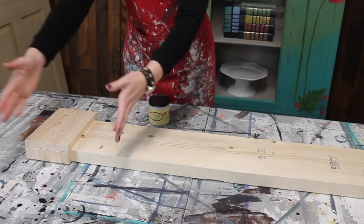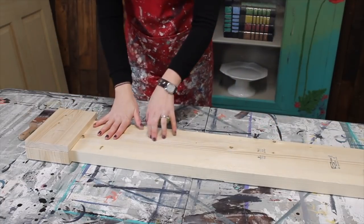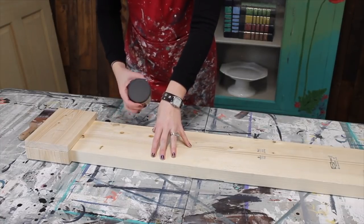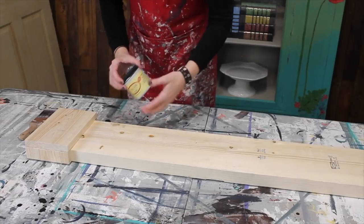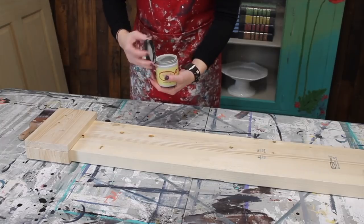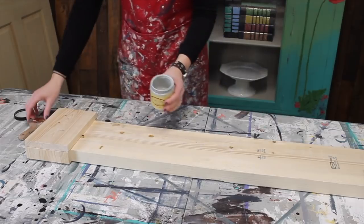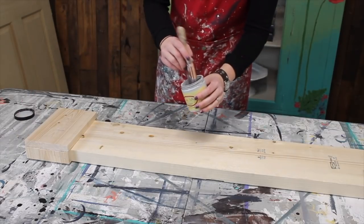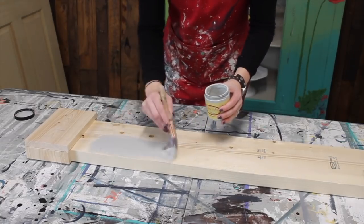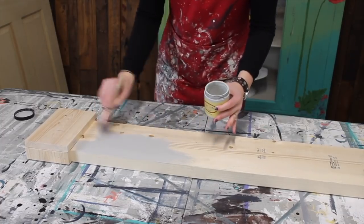Here is my piece. These are the two sides of the mantle that will go down. It is just raw pine. I actually have not done a thing to it, and I don't mind some of the texture — I'm okay with the roughness of the wood. The first thing we need to do is give us a base coat of paint. I'm going to use driftwood. This will be the color that will show through the cracks. I'm picking driftwood because it's not a super contrast, like black. The mantle is going to be white overall, but it's just going to be enough that it's going to show up as a different color and give us some good texture underneath.